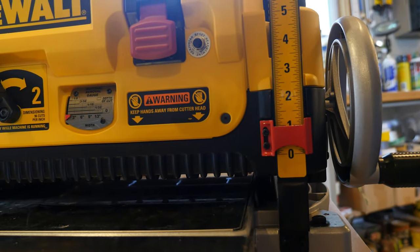You can see the inlet to the squirrel cage where the fan picks up all the chips and ejects them out of the way. It's very efficient — not 100%, but you can clearly see the cutter head right here. It's triangular in shape with three cutters rotating against the direction of feed, which is always how woodworking tools work — if the feed matched the rotation, it would simply grab and jam the wood. When it comes time to replace the knives, you use this included tool, which features a couple pairs of rare earth magnets that let you grab the blade and lift it out once loosened. Great forethought by the DeWalt engineers.